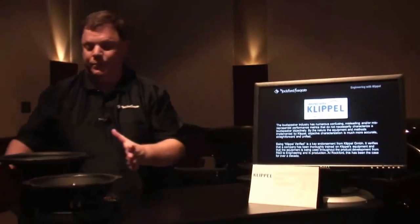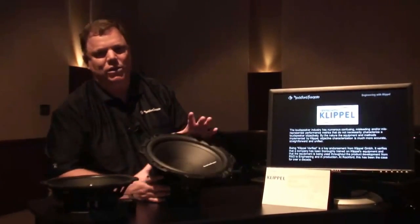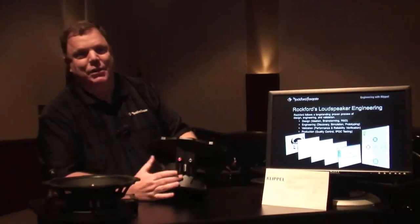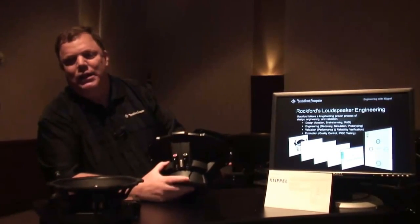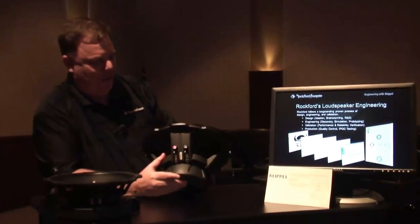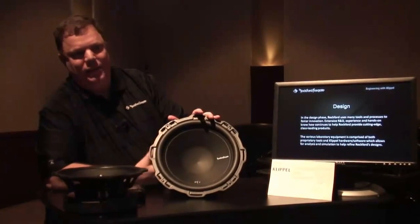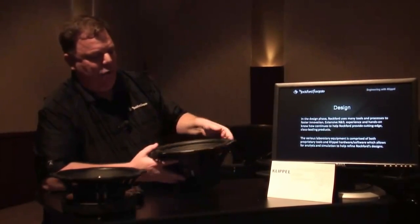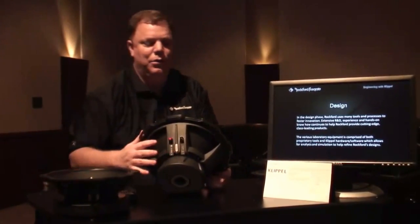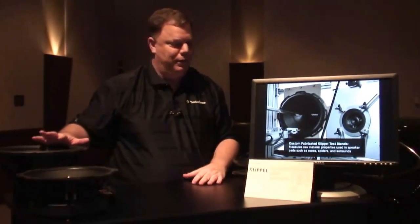So that's our new Pro Editions. One key thing — we listened to our customers and received a lot of feedback saying that matching amplifiers and power with subwoofers in single and dual woofer configurations didn't match up well. We had a long-standing single voice coil on our P1 series in 4-ohm and 8-ohm. Well, we discontinued the 8-ohm this year and we're putting in a 2-ohm. So this is now available in 8, 10, 12, and 15-inch single voice coil 2-ohm, which allows for a lot more amplifier configurations to match up with the P1 family single voice coils.